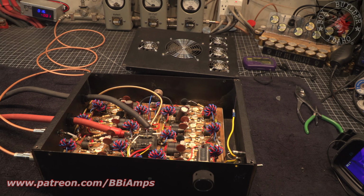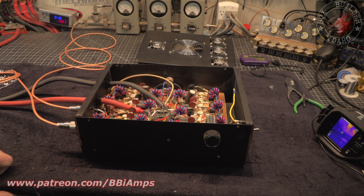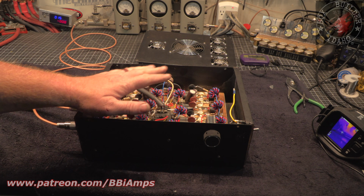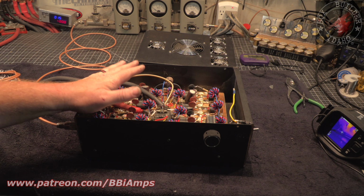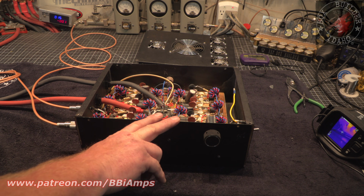Remember, this amplifier likes to have higher voltage. So as I was explaining to the customer, back in the day, these guys would run off a big battery bank, 18 volt battery bank. And they'd have two little alternators, and the key, they'd run right through the alternators and just run off the capacity of the batteries. So this is not quite as efficient as our current style of builds, but these boxes kick ass. They're designed to be driven a little bit harder, and they're totally designed to be hit with higher voltage, for sure. This would probably do even more if we would isolate this out and go closer to 16, 17 volts.